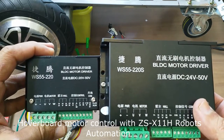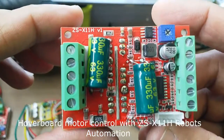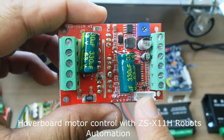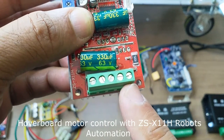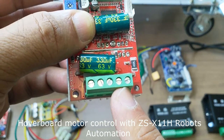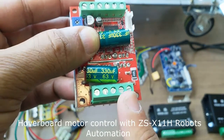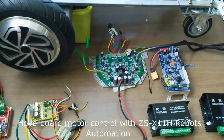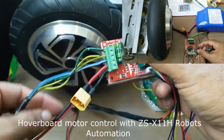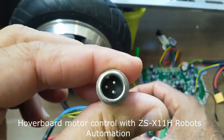With those controllers you apply voltage, enable, and PWM to control motor speed, stop, start, reverse, and forward — everything you can control. But with this controller I tried without connecting the hall sensor cables and the motor didn't run. Phases A, B, C then positive then negative. Here I will apply from 42 volts using the same hoverboard battery or adapter. I also tried this with 12 volts and it is working, so even a 12 volt car battery works.